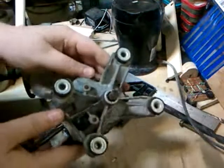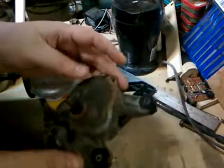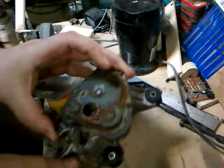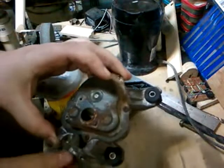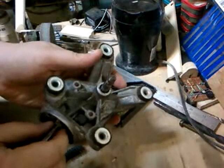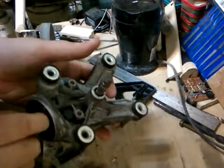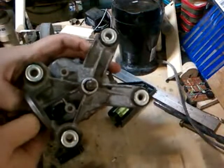So I found this — it is a part from a windshield wiper motor. The electronics and the motor have been removed. I was going to use it for an indexing table since it's pretty much a worm gear setup. But after calculating it out, it's a one-to-fifty-five, or fifty-five-to-one gear ratio. If you try calculating that out for plates and stuff, it's a nightmare to do.